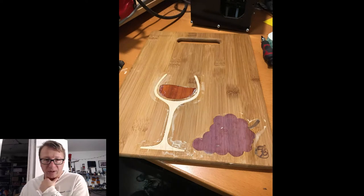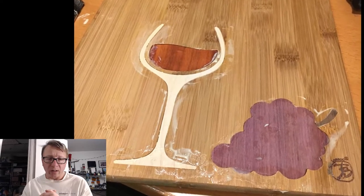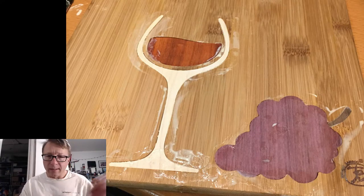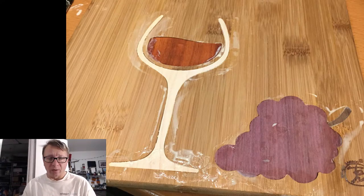In this case I actually intentionally went overboard with the glue because the tolerances were out of spec, so I wanted the glue to fill in some of the gap. In the next picture you can see all the pieces pushed into place and the glue squeezed out a little bit. What you do is take a wet paper towel or wet cloth and wipe it down as best you can, removing all the glue from the outside. The glue here is Titebond 2 — it's food safe and it's a carpenter's type glue, which is fantastic for this.